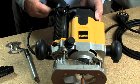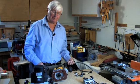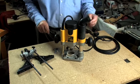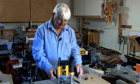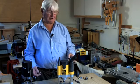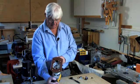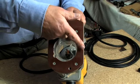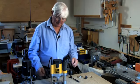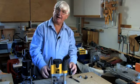For some types of routing such as dovetailing, the base has the same two six-millimeter tapped holes — the Elu, DeWalt, Trend standard. But above all, the great glory of this particular router is its dust extraction — it's about the most efficient one for handheld routing that I know of. What we have is a rather elaborate base casting with a chute that goes through and up this large-diameter plunge leg, which is hollow, and out through the top. You simply plug your hose connector into the top and away you go.